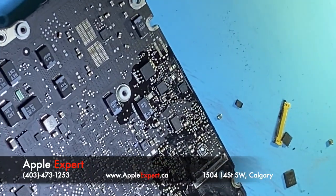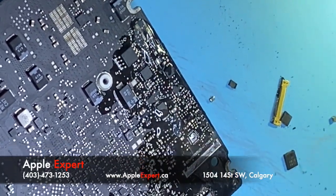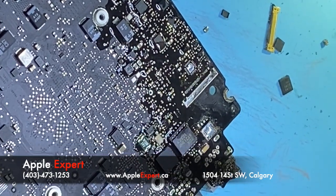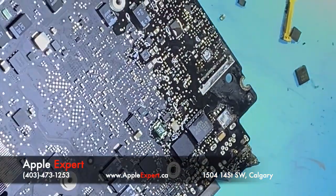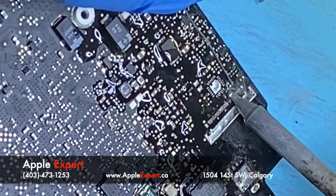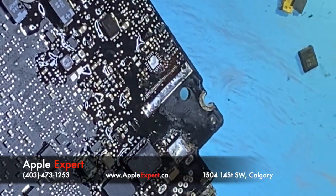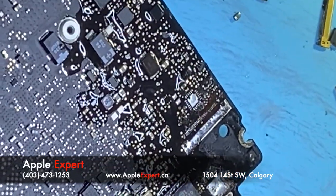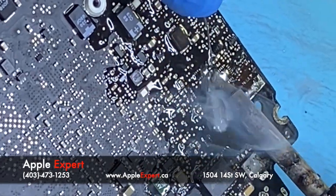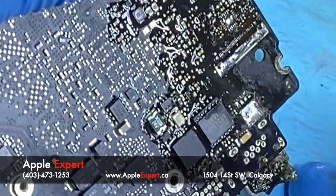Okay, I'll stop here. I'll clean the area. I'll put the new chips, connectors. I'm tinning now all the pads. Make them nice and clean. It'll take time, but we'll get it done.